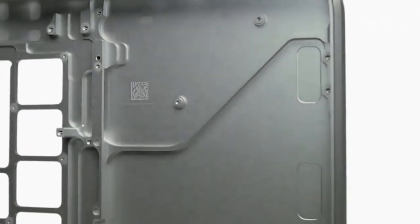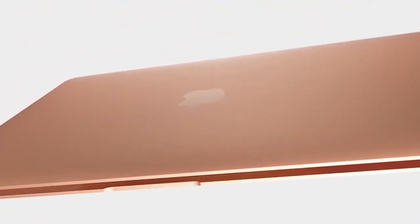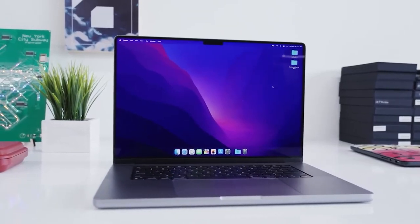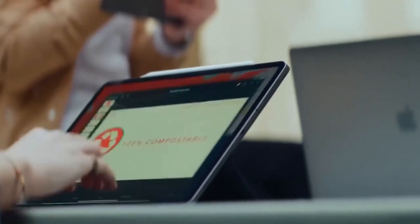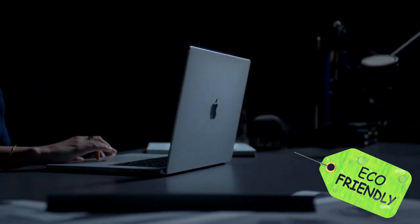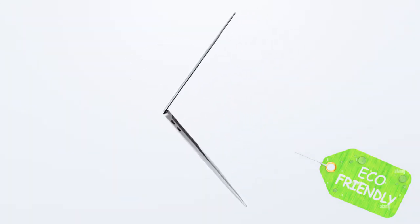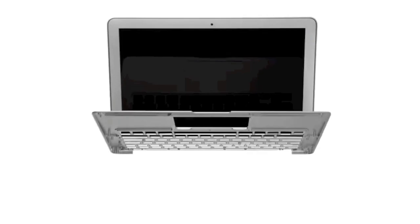That is about it for the body. You may wonder what happens to the remaining metal from the original block that the CNC chips away. As it turns out, in an effort to be more environmentally friendly, Apple collects all those shavings and melts them to make more laptops, making the MacBook the greenest laptop out there in spite of the expensive material cost. The same process is applied to the bottom plate and the lid, which also gets the iconic Apple logo — etched and polished directly onto the metal instead of being a separate part, as many people think.